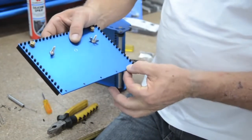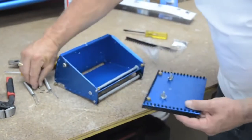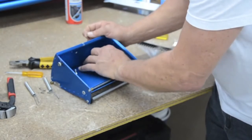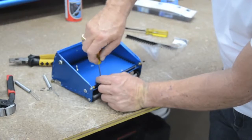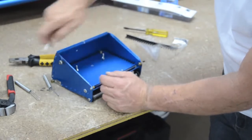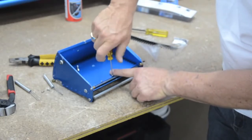We retrace, fit the blade back onto the axle inside the box, attach the screws, and then you're ready to go. And just make sure everything's nice and clean in the box there. The screws. Just rotate around until your holes line up. You only nip these up softly, you don't go dead tight, but you put all the screws in, because sometimes if the box you've got is a little bit old, these holes can be fractionally worn, which will allow the screws to move and the lid will not be tight inside, so we've got a trick for that too.